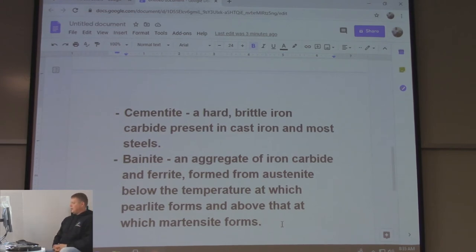But anyways, I put it in there, and it was mixed kind of hot. It's 25%. I think you're supposed to have, on that sheet I gave you, low-carbon steel, 2 to 5% nitric acid. This was 25%, so follow the ingredients too, by the way. Because what happened was I forgot that it was souped up when I did it. I think I said 5% in the video. Then I looked at it and it was written on it, 25%.